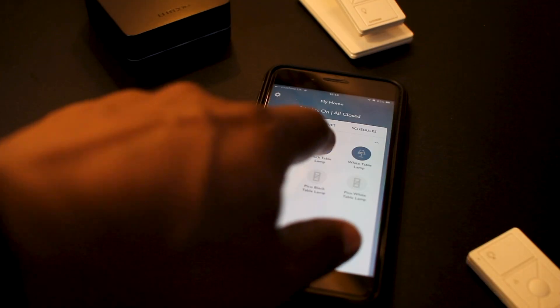On both systems, clients can use their respective Lutron app to control their lights. The other main point regarding programming is that on the Lutron RA2 Select system, the Lutron RA2 Select app will allow you or your installer to entirely commission the system — activate all the RA2 Select equipment during installation and program the system with that app. The great thing is this app will also allow clients to modify their programming over time and activate new RA2 Select equipment, which is very easy. Lutron Homeworks QS, on the other hand, is more involved when it comes to programming — the system needs to be entirely commissioned and pre-programmed by a Lutron professional before the end user can fully take advantage of their Lutron Connect app. If you need to add equipment at a later date, a Lutron programmer will have to set it up first within the existing program.